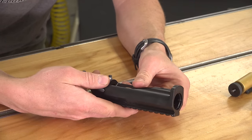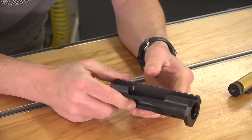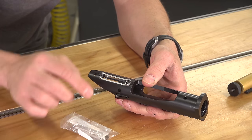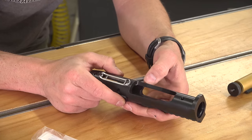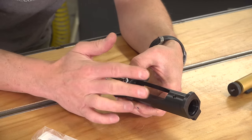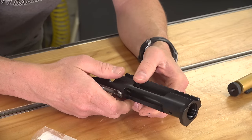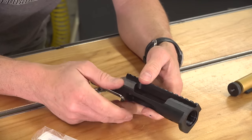The overall finish is absolutely outstanding. It's got an external bolt stop, so you don't need to use the trigger-well-type factory Remington 700 bolt stop, which can be a bit clumsy. There's also an integrated trigger hanger with multiple options for trigger placement, letting you fine-tune your trigger setup. It's got a wide bottom opening to accommodate AI mags in double-stack configuration, and a large ejection port optimized for fast action — a feature inherited from the VR bench-rest action but adapted for tactical use.